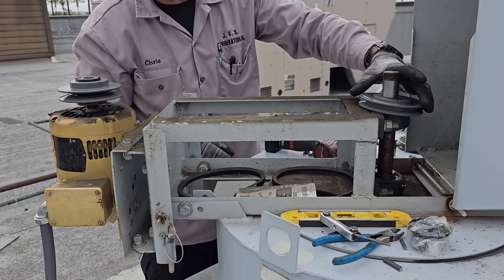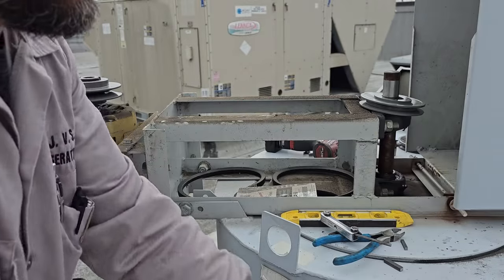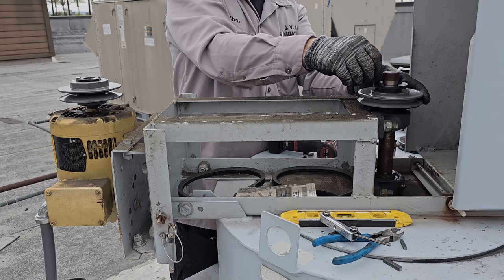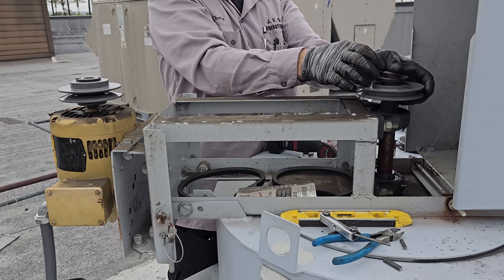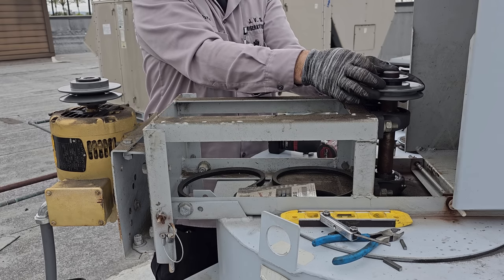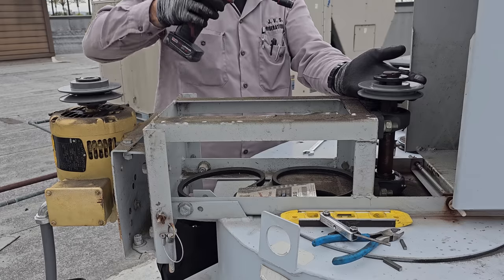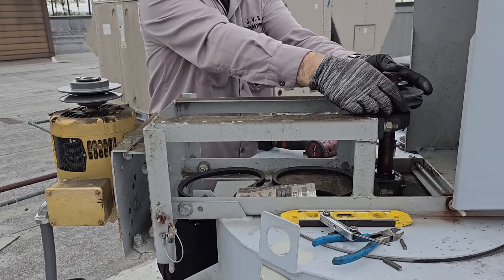We got this new one. We got a new taper. New screws. So the threaded holes on the top of the taper are for removing the taper, and the non-threaded holes are for tightening it. You don't want to have threaded going into threaded because it won't tighten right. Just gonna snug. Nothing tight, so that way we can still go up and down.